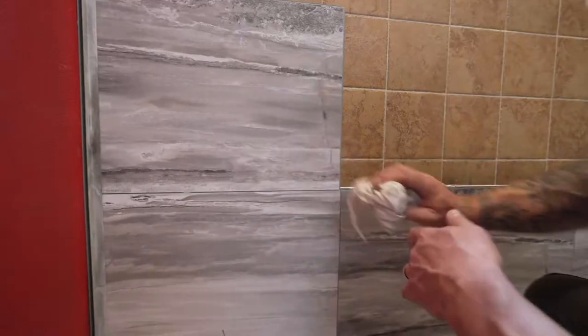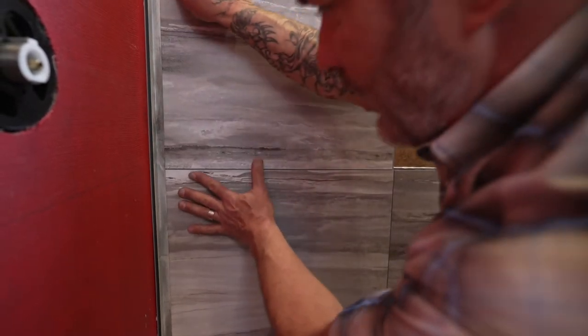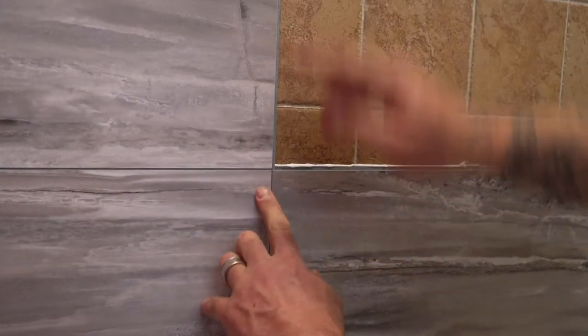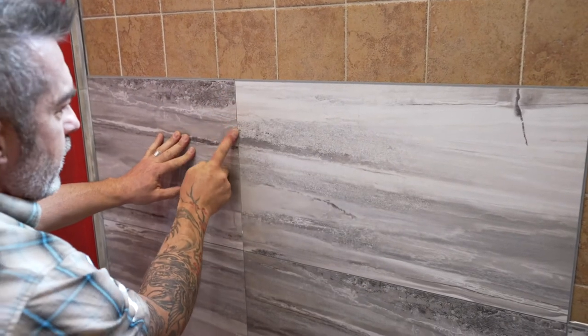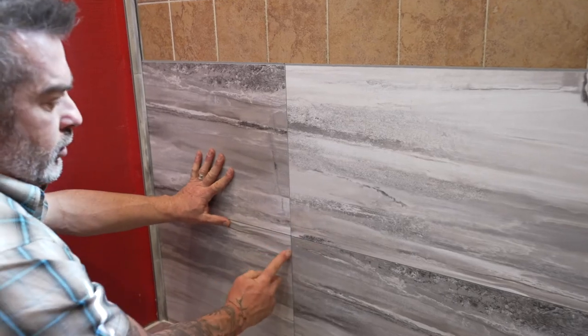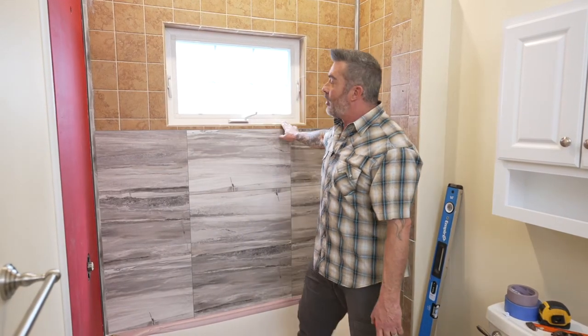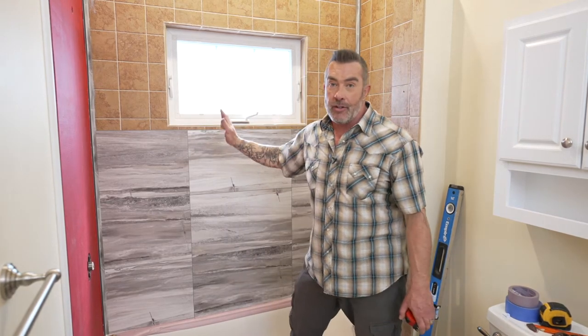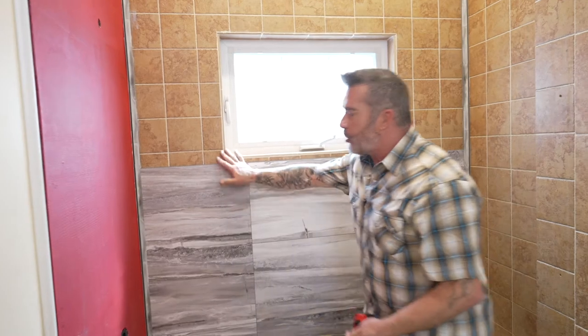You may need to take a wet rag and wipe off any excess sealant that gets squeezed out of the joint. Make sure the joint is nice and tight, then slide the tile into place making sure all seams line up. Repeat that process — put the next tile in place for a nice tight waterproof joint, wipe off any excess, and always be mindful that all seams line up as you go. After three full courses are installed, you may need to make cuts — for example, to go around a window. Measure from the track to the inside edge of the window and the height, transfer measurements to the tile, cut on the saw, and dry fit before installing.